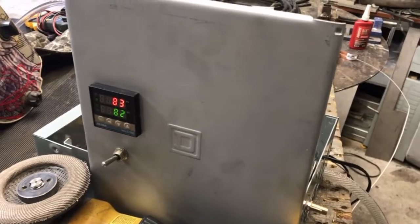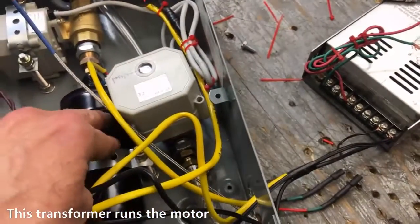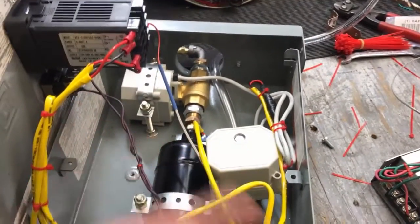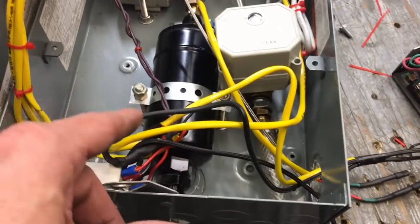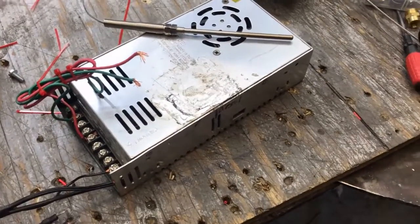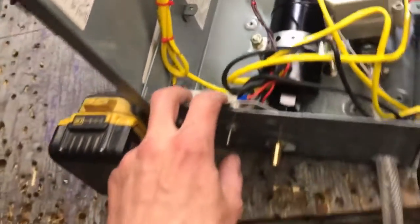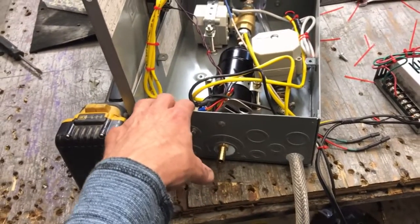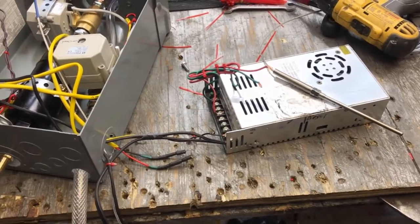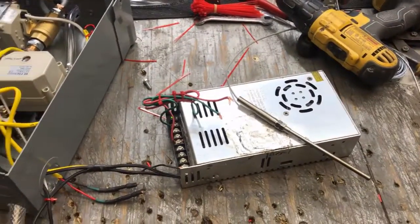There it goes. This transformer shuts down the fuel pump — that's how we're shutting the fuel pump off. We can't just shut the valve and let the pump sit there, though this particular pump allows the fuel to travel directly through it, which is cool. For those of you really into electronics and process control: there is something about these solid state relays — I had a build in the past where the same phenomenon happened and I couldn't get the solid state relay to trigger. Now I know: just hook a voltage draw onto it somewhere and it'll work.